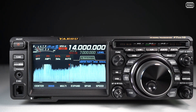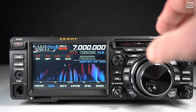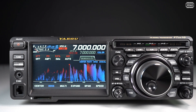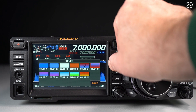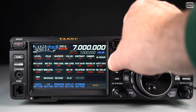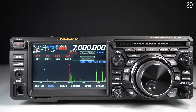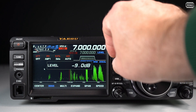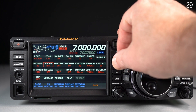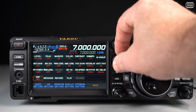Selecting a band with the ring — after a second it goes to the selected band. I could also push on the display with the mouse or finger. What a noise on that band! Let's go back to 7 MHz. As I mentioned, the function button has a very important role. You can assign whatever function you like; currently I have selected color, so when I turn this button I can select from 11 color patterns for the waterfall display. The function currently assigned is shown here, and I can put any of those functions on this button. The default function is level — the signal level of the waterfall display. There are many other functions I can assign, whatever suits your current mode of operation.